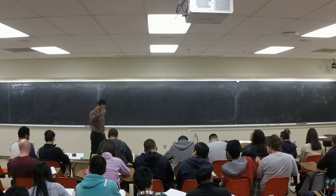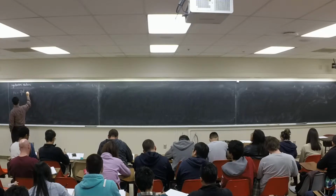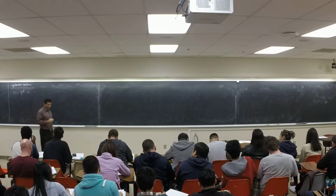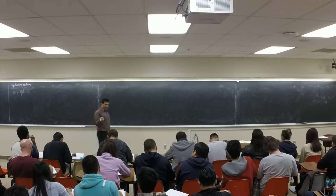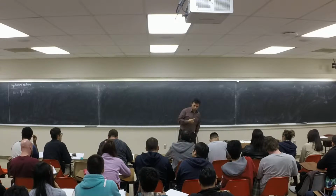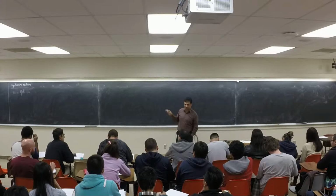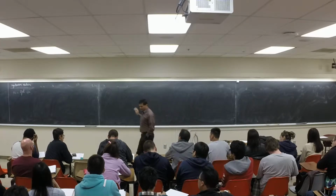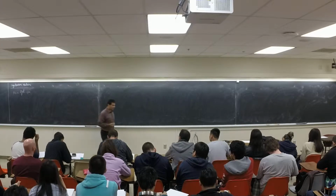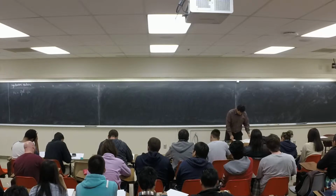And the machine is going to start, and this is the RPM. This is the mechanical speed. You know the relation between the mechanical and electrical speed, right? We say electrical speed is P over 2 times mechanical speed, right? Exactly the same thing we said for the DC machines and induction machines. Now, let's look at the structure of the synchronous machine.